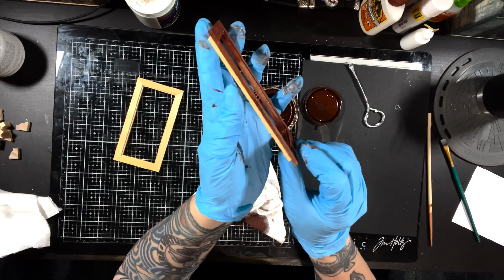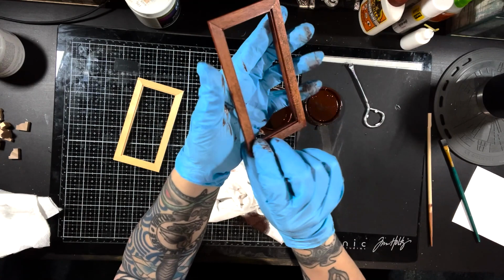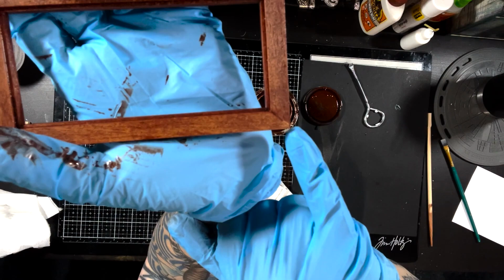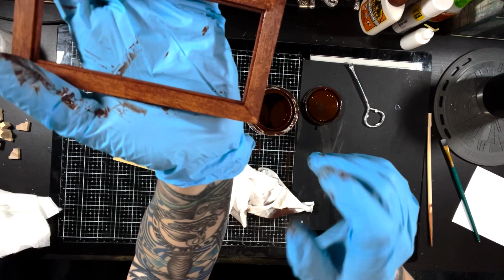That we got that surface. There's a little bit on the back, there's always going to be, but we know getting around that. So all you do is basically, and that's how easy it is to stain, by the way. You can use a brush if you want. Some people prefer it. You can see a little bit here. This is what happens when you have wood glue that dries on the surface, and so it doesn't like to take the stain very well, but still does pretty good.